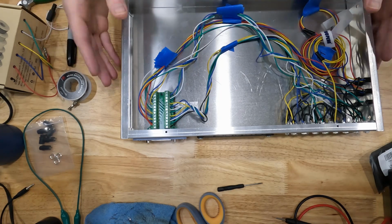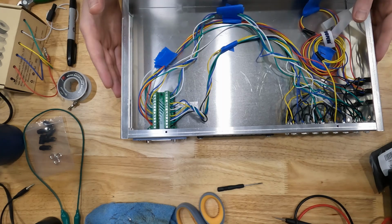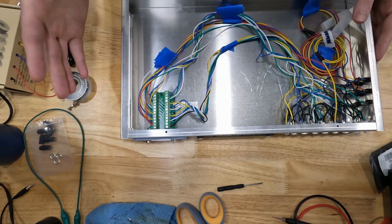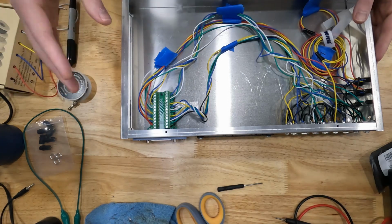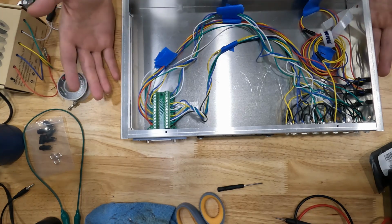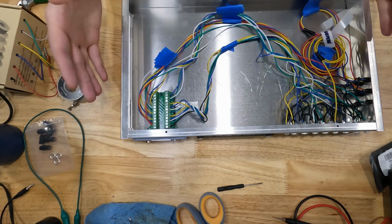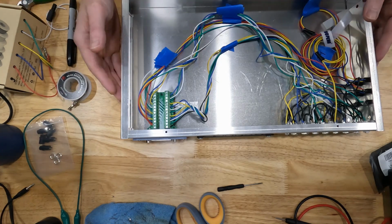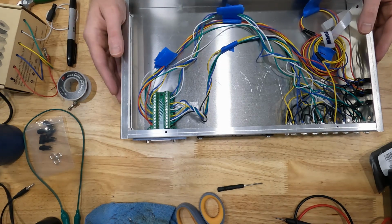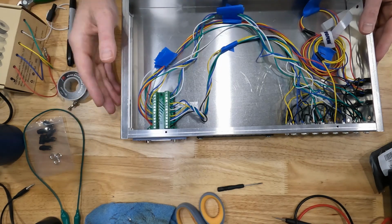So I didn't pick pin numbers based on anything intelligent. I kind of randomized it. I did try to keep the D-pads, directional pads together, like up, down, left, right. Those 4 are in a row here. For the PS4, the X, square, triangle, circle, I kept all those together. So I did kind of try to make it smart, but other than that, it doesn't matter what pins you use. Just record what you do so that when you wire up the interfaces, you can be consistent.